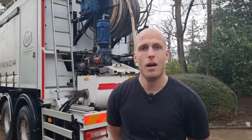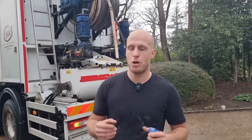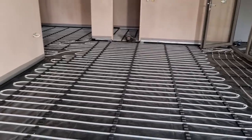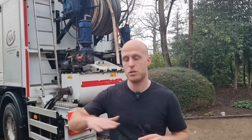All right, so on your closing piece, tell us the top tips for people thinking of having a screed, what they have to do. With a liquid screed, I think you touched on it earlier. I think floor preparation is the most important part. Really take some time getting that polythene in, getting your corners cut nice and tight, taping at all your joints. The more time you put into the prep, the better your screed's going to be ultimately. It saves us having to rectify it when we get onto site as well, but you end up with a much nicer finish.